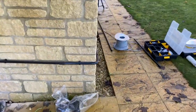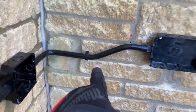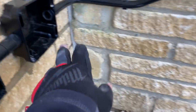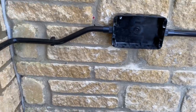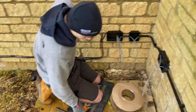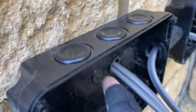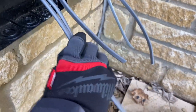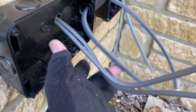There we go — the pipe swoops around the corner, comes around to the Kinetic receiver box. I had to pull a set and an internal bend round — doesn't look too bad, to be fair. The bins are going to be in front of it anyway. This is the unswitched spur, the double socket — we can now actually get some wiring done. Pull one mil two core this way, James — one mil two core. Then we'll get second fixing. Sweet — that went in alright, didn't it? Just enough.